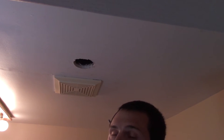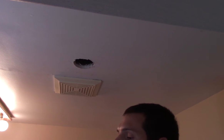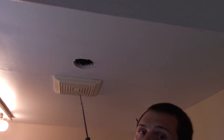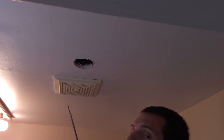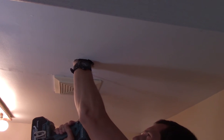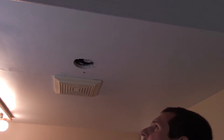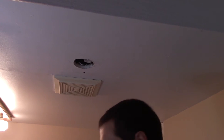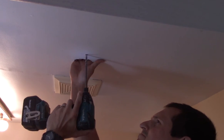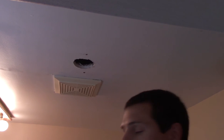There was a black gasket on the bottom of this duct that I put in. You want to drive some drywall screws through the little flange to squish it down — that way you get a proper air seal. Don't put drywall screws in your mouth. The nice thing is I won't even have to fix these screw holes because they'll be under the diffuser. I'm pinching it down as I'm putting the screws in.